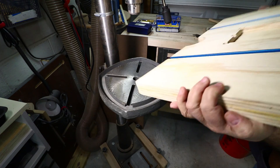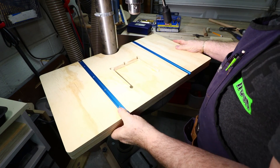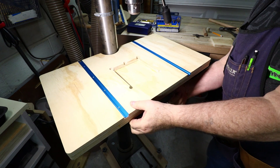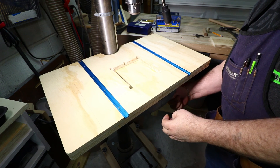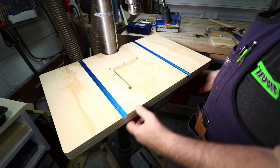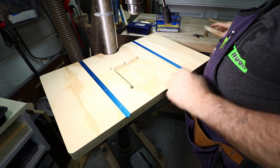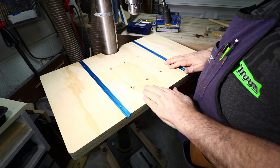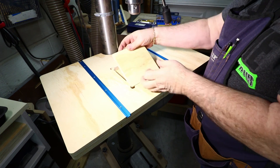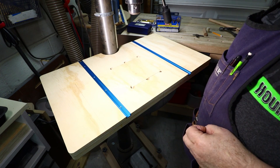The glue has dried on this dowel — it's stuck in there good. I'll flip this over, get it to drop into the hole — drops right in — then all you've got to do is tighten up that 5/8 bolt into the hole on the bottom side and everything lines up perfectly and holds very solidly. Perfect — everything is lined up perfectly. I've got my inserts here to put in, and as I wear them out I can rotate them in different directions. That's what I love about having a square insert. Perfect job I think.